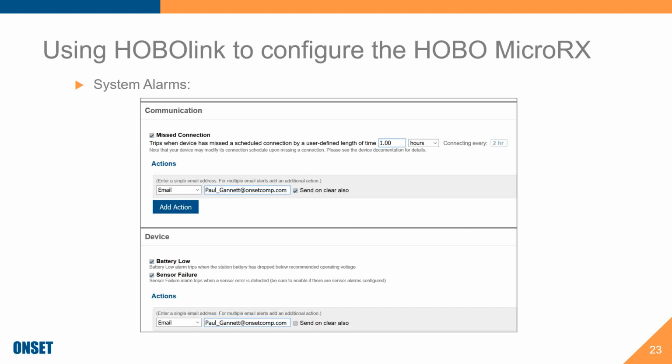Yeah, there's just somebody double checking on the alarms as to when they're sent, whether it gets sent at the next readout interval or automatically when the threshold value is reached. The alarms are sent immediately when that threshold value is reached, as determined by the logging interval. So if you're logging every 15 minutes, it's checking that alarm condition every 15 minutes. If you want to get fastest alarm notifications, you probably want to set up a 1-minute logging rate so that it's checking as frequently as possible, and you'll get notified as soon as that threshold is reached.